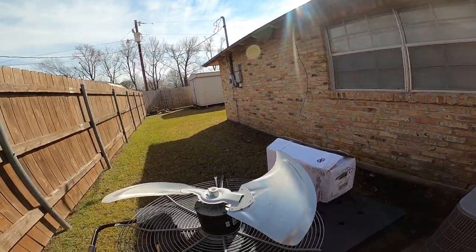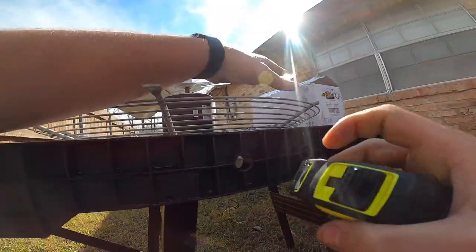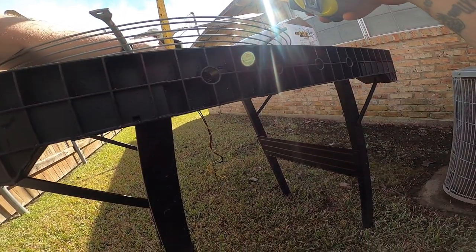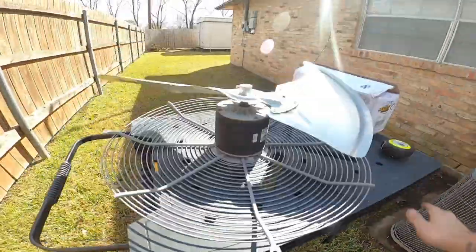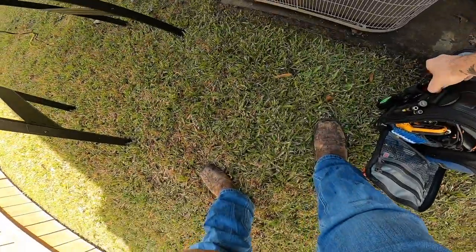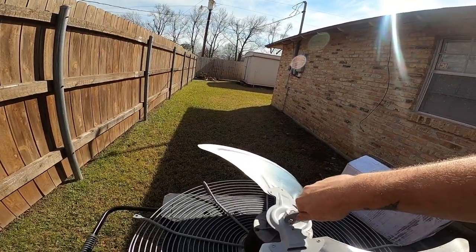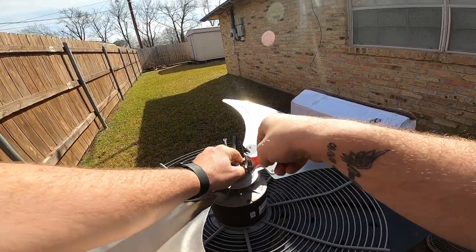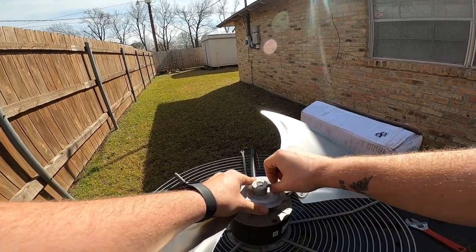You know, one thing I don't see a lot of you guys do is this right here. Y'all don't measure the blade. I'm gonna measure it right here to the corner. That is 5.5 inches. And that's pretty important to do there. A lot of you guys just kind of guess and put them back wherever, but it's not really the best thing to do. You should measure it.